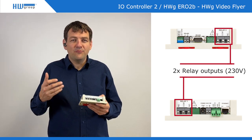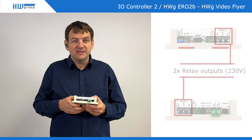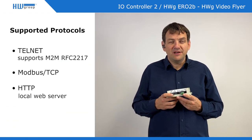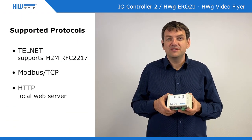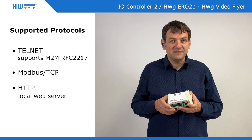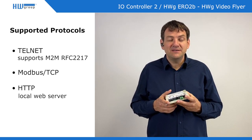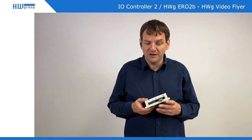When you are working with this device, everything uses one protocol only, and that's Telnet. Pure Telnet sends data to the serial port. An extension of Telnet is used for controlling the outputs — basically the same extension used to control serial speed or baud rate. This is RFC 2217, and in Hercules it's natively supported and fully documented on our website.